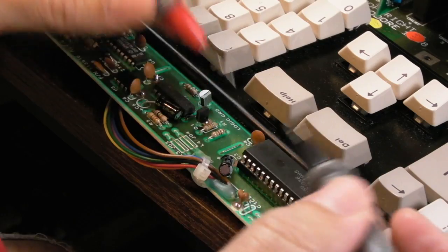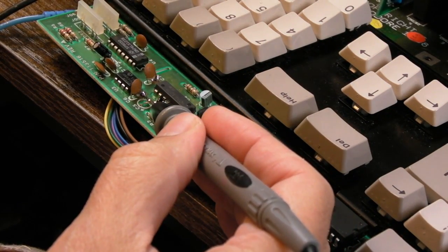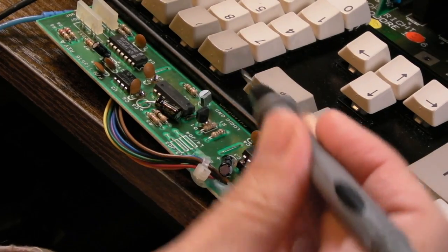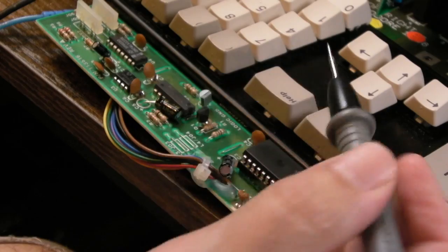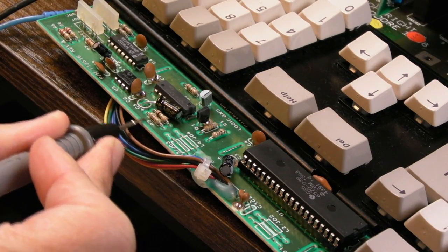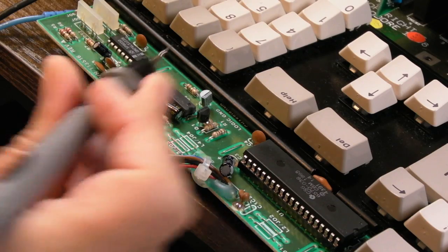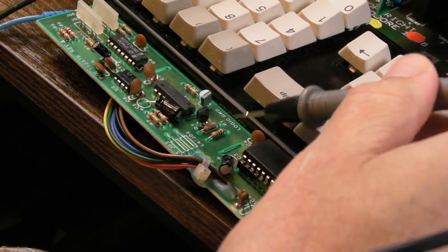The next thing is this cap here and some of these ceramics, you can see that blob of solder there? It looks awful. It needs a bit of flux. It needs some braid to remove that solder. We just need to work out what's going on with the pads. But if you look at the extended green surface area here, this is going to all be ground. Yeah, it's very common to have large areas of the PCB like this with ground.